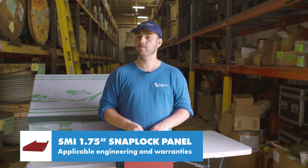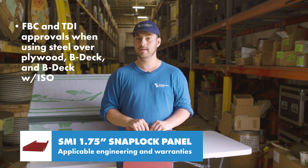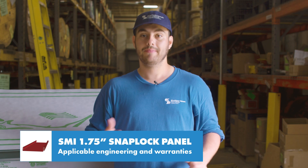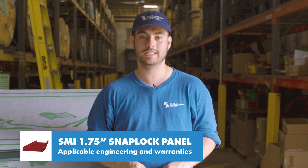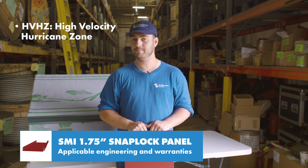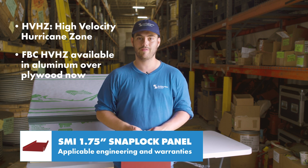For projects located in Florida or Texas, the panel holds both FBC and TDI approvals when using steel over plywood, BDEC, and BDEC with ISO. This panel is eligible for use in weathertight warranty projects through Sheffield Metals and qualifies for the standard SMI 40-year PVDF paint warranty and Galvalume warranties. Some upcoming testing for Sheffield profiles includes finishing HVHZ approvals for Florida, upgrading some non-engineered profiles to have testing, and doing even more testing on current engineered profiles.